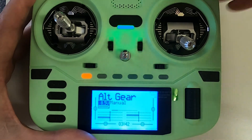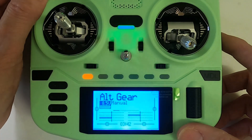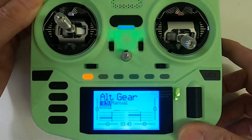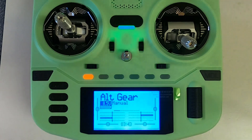When the airplane drops below the level you've set, this will happen — there we go, it's told you the gear has gone down. Now nothing will change it, because you don't want the undercarriage moving unexpectedly while taxiing. If you push the main gear switch forward, nothing happens — it stays down. To bring it back up, there we go — we're back to normal.